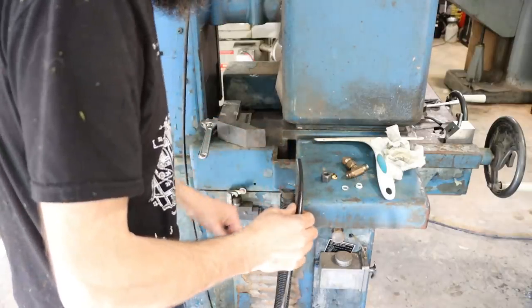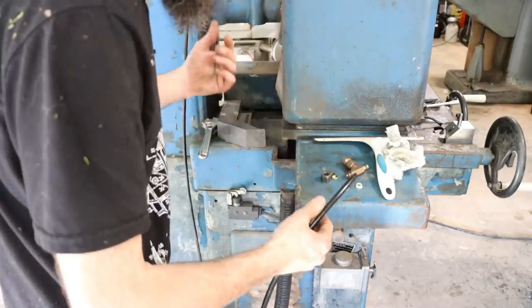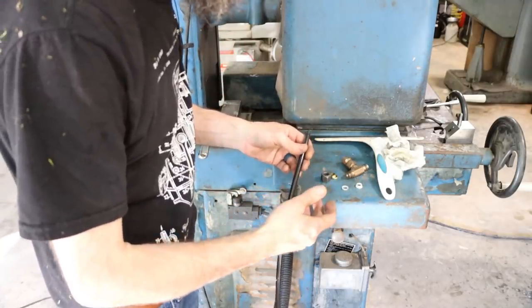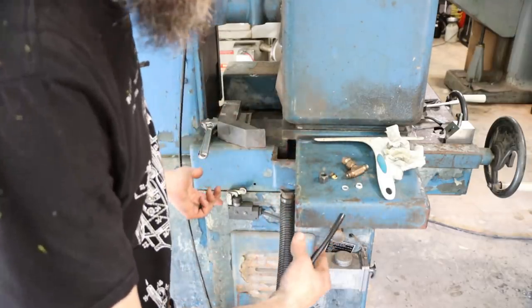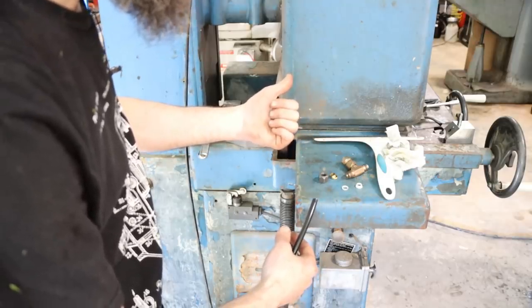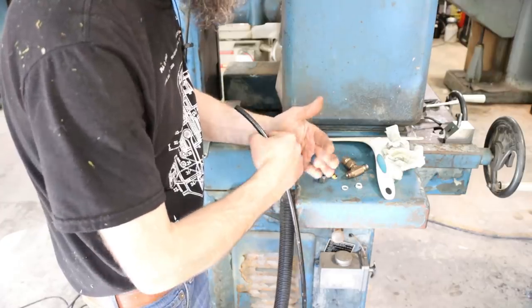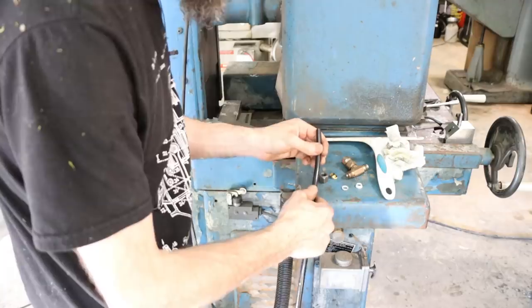So man, that made a heck of a mess. That shot all over me, in my face, in my beard, on my toolbox, probably 3 gallons out on the floor. Now the reason why this line came off is because, for one, it's not set up properly. When I turn off the coolant up here at the grinder head, it deadheads the pump. The output of that pump has nowhere to go. All that pressure builds in the line. That's a pretty stout little pump.